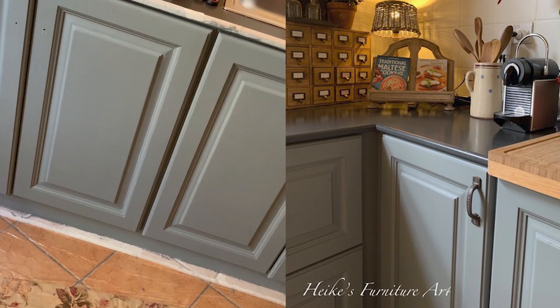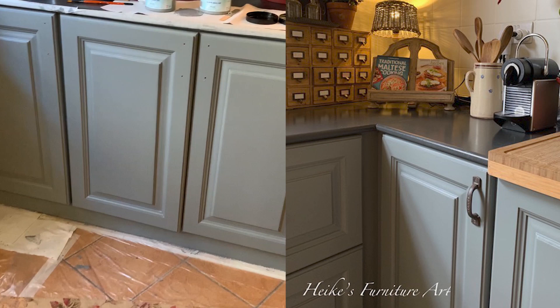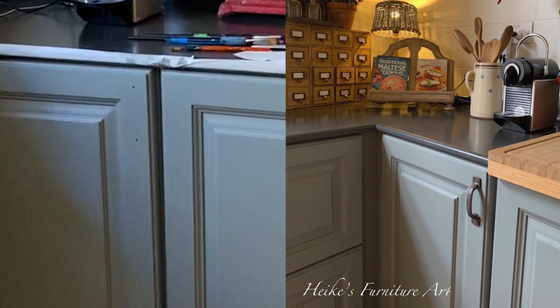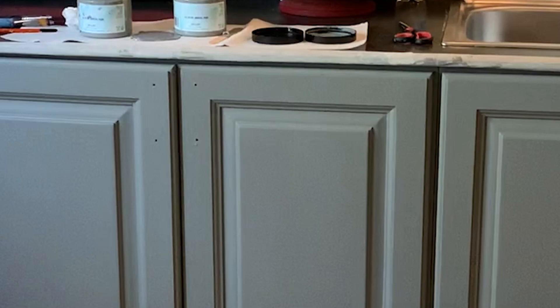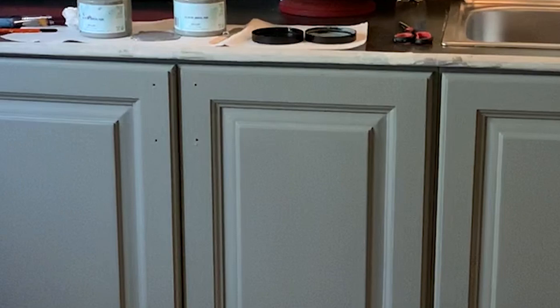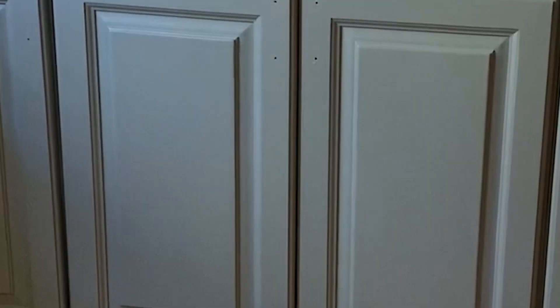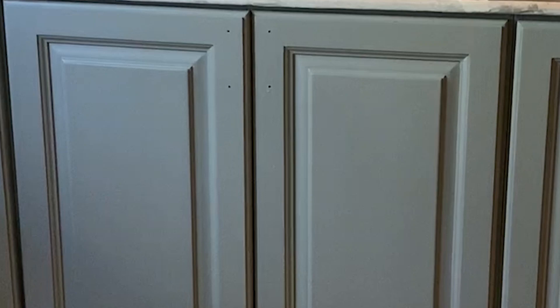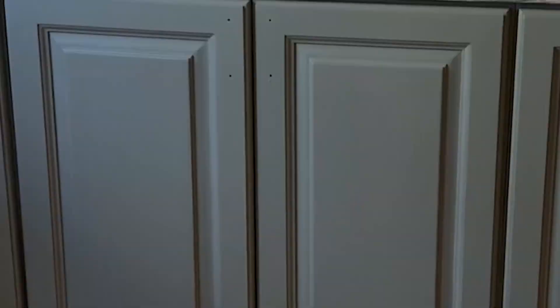Fantastic paint — really, really nice to work with, to brush on. Now my kitchen has a new colour. I have a small kitchen and we were a bit worried that the Wharf gray might be slightly dark for the kitchen, but once we put the handles back, I think it's just a lovely gray. It's extremely important to let the paint dry, and then the paint needs to cure — as with every other chalk and mineral paint, it needs to harden for about 20 to 30 days, depending on the climate you have.